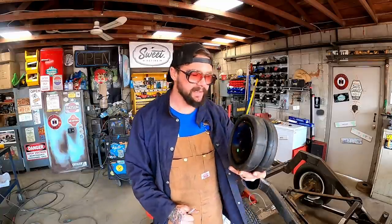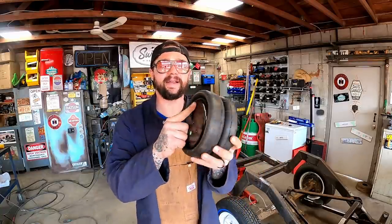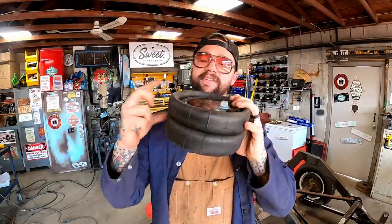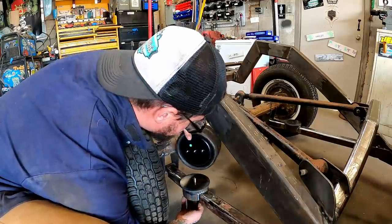There we go. Before we slam down that doodad, we're going to put our collapsed airbag. And you can see how that bottom plate, or the top plate, kind of sucks in and this baby balloons out. And that's where our little riser, our little lift kit down there, comes into play. Let's take her bolt, our bag, get her on. Bring her up from the bottom side.